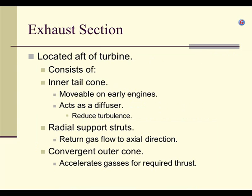Now we're out of the turbine section — the gases have to go out the exhaust. On a subsonic engine, all exhaust components are fixed in shape but adjustable to some extent. On older engines, the outer exhaust cone was manufactured longer than needed. When the exhaust cone was installed and the engine run, performance was lower than expected — all due to Bernoulli's principle. The longer and more tapered the cone, the smaller the opening; if too small, the gas velocity creates a shock wave.